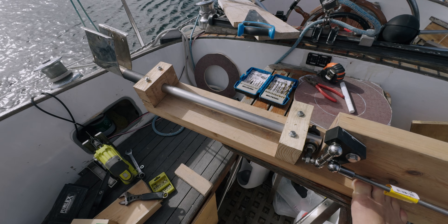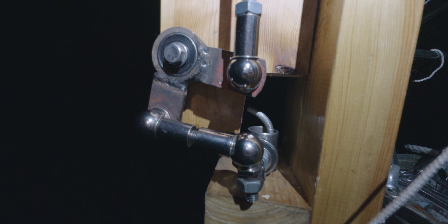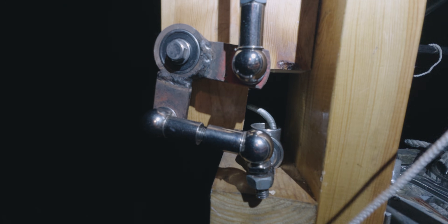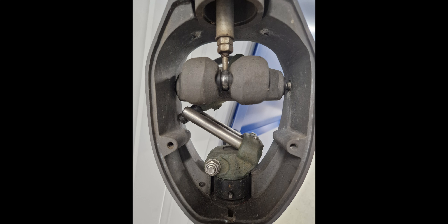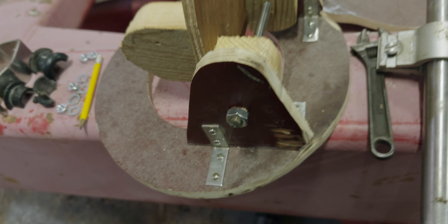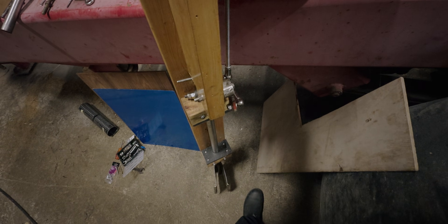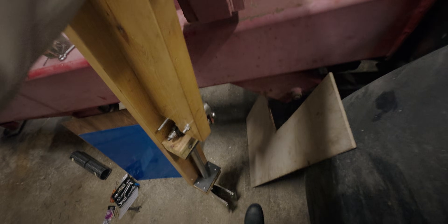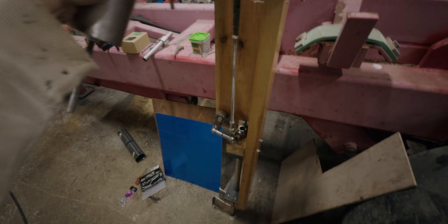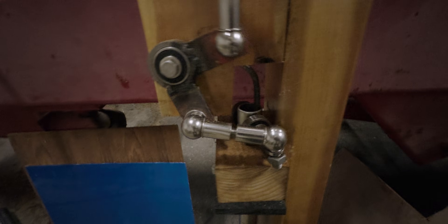The wind paddle motion needs to be translated to a pivoting vertical shaft with a rudder. This can be done in several ways. I decided to try a classic L-shaped part for this and some cheap joints from Biltema. I was considering brake wires, some kind of Hydrovane diagonal copy, angle grinder gears, or simply ropes — all would probably work to some extent. The rudder needs to steer in the opposite direction of the push from the wind, so the boat steers itself back and the wind paddle straightens up again, then flops over and steers in the other direction. It took me a long time to come up with the design, as I strayed through different ideas because I haven't seen anyone try this combination before. I think it's quite a unique design and easily copied.